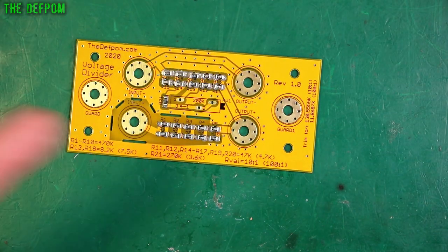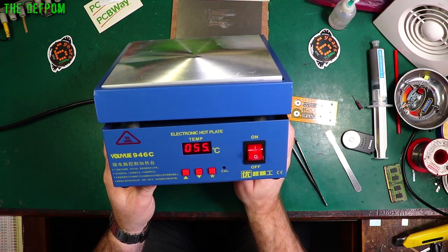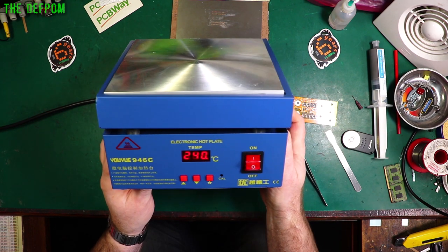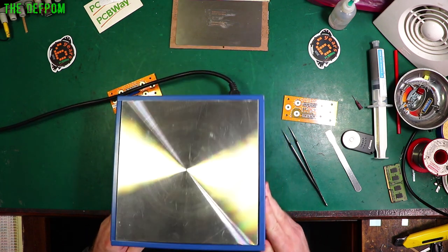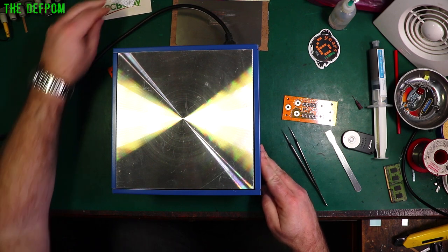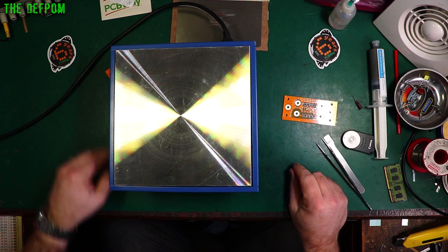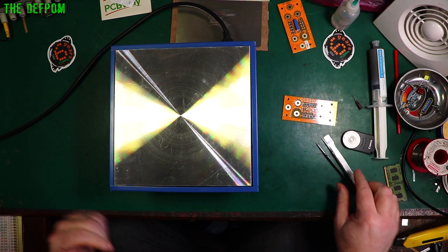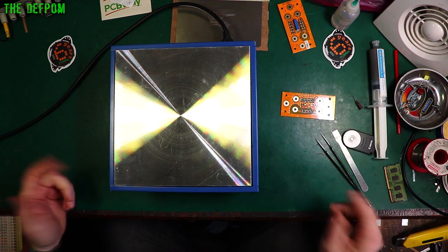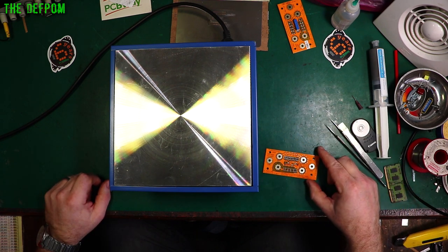You can see all those parts on there. Let's solder them on. I'm using a hot plate set to 240 degrees. We'll heat it up and drop the board on, giving it a chance to warm up a little bit first — otherwise it will evaporate the flux off straight away. That's what happened with the other board I made. The flux was evaporated off before it needed to, resulting in parts being bridged. So we'll place the board on and watch it melt together.